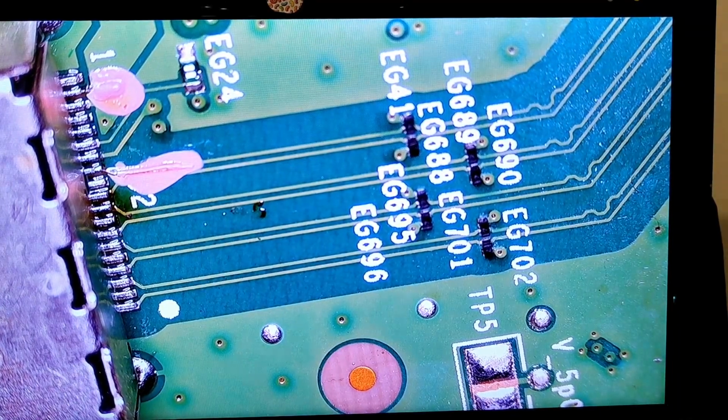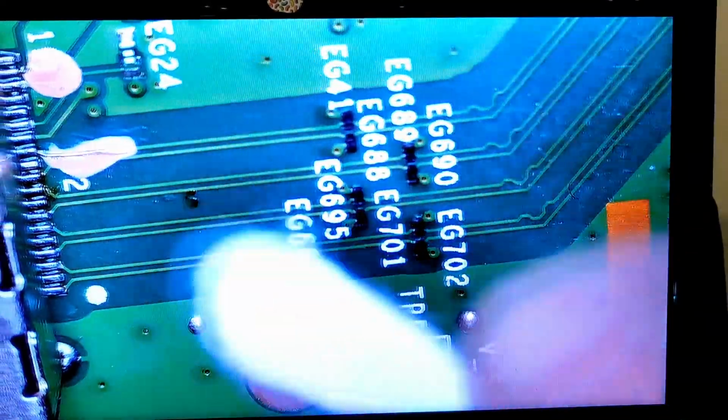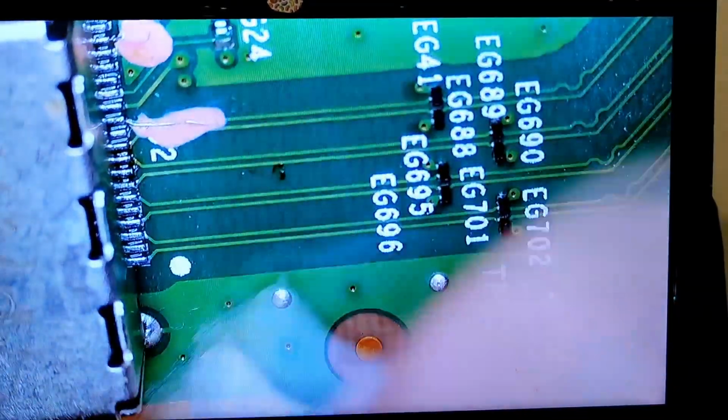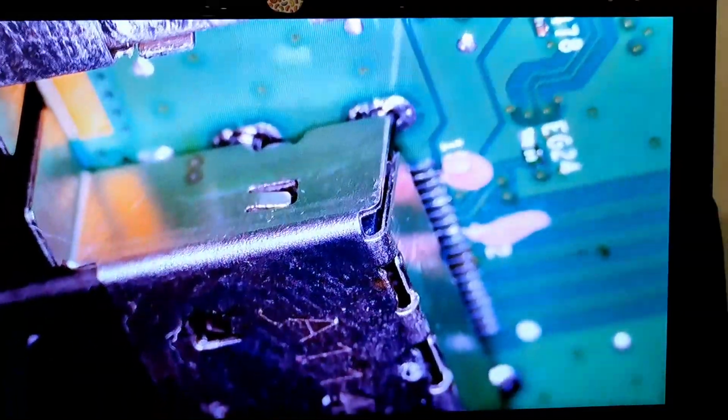Okay, I think we're on. Do a dab. Dab where I can. Give it a wipe where I can. Check inside the port, make sure nothing melted, because how long I had it on for. Those ground legs don't look that good, do they? Let's have a look. Let's do a wiggle test. Solid. Check the other side. Okay, the other side needs cleaning up a lot. So I'll have to go at the back there quick. Oh, if I can get it under the scope. Yeah, not that pretty.